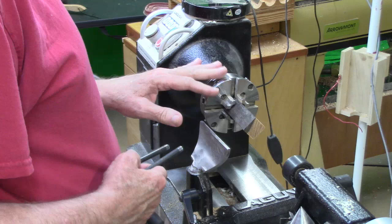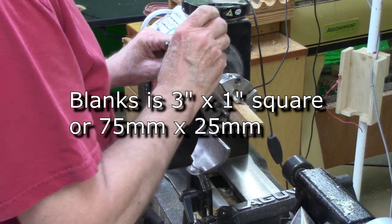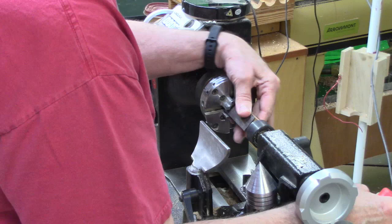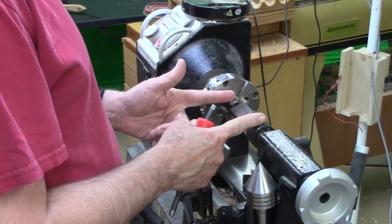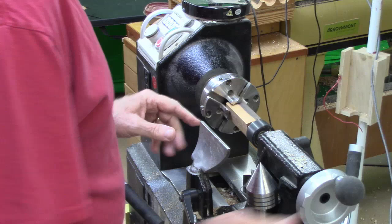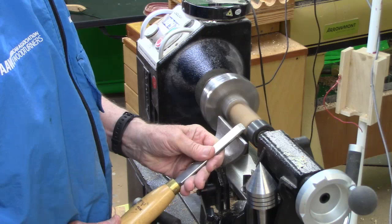Unless you plan on turning a much larger piece, the piece of wood we're starting out with is about three inches long and about an inch thick. You want to mark center because you're turning it this way with the chuck jaws. You could also start this project off between centers. I'm using a little set of Record Power spigot jaws, and I'm going to leave tailstock support there for just a moment while I round this off and take very small peeling cuts.